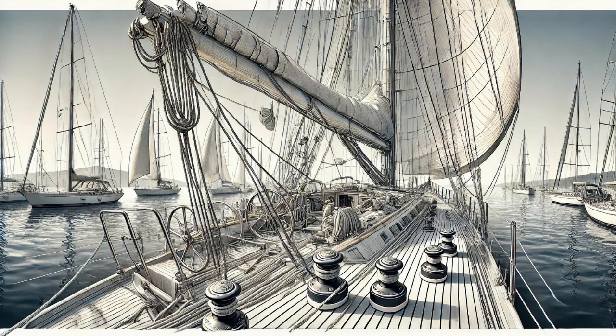Absolutely. On unpainted aluminum masts, you're looking for pitting, those tiny holes or craters, and a white powdery substance, which is oxidized aluminum. A little bit is normal, but if it's excessive or accompanied by deep pitting, that's a big nope. Should we be running for the hills at that point? It's definitely a sign to pause and gather more information. A marine surveyor can help determine the severity of the corrosion.